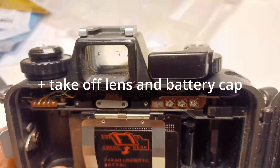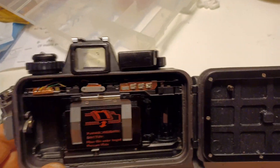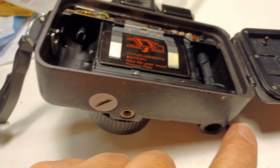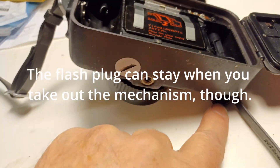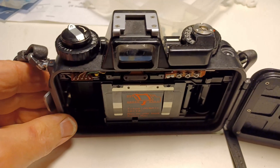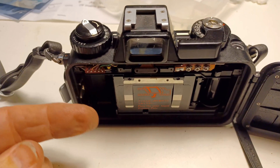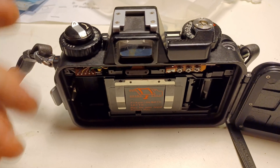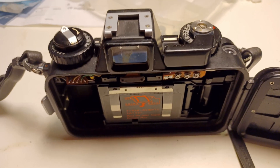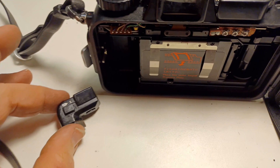Before you can do that you have to lift out the thing inside. And that's it — you can grease up all your o-rings and put it back together. It worked after I did the o-rings here and here too: the flash connector and the battery. It didn't work immediately after because after so many years without use, the different connectors — copper to copper — had oxidized, but after 5-10 times using it, it started working. So now it's working. This one I'll just glue back in place because I'm not going to worry about drilling out that screw.